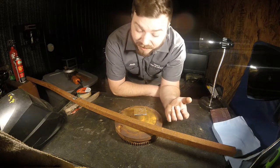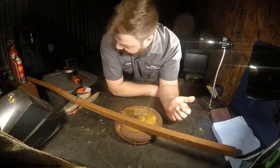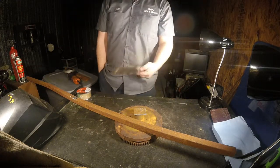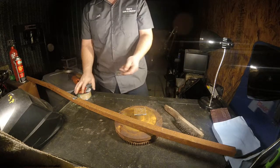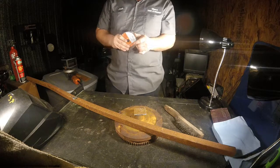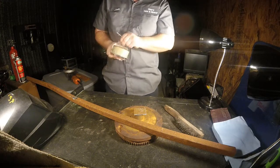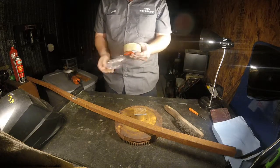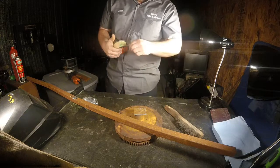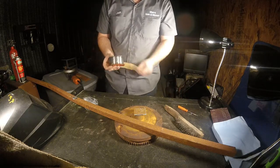And these welds aren't going to look very good because of the dissimilar metals and the rust and all that good stuff. But I'm not even going to use this except to get the slag off of the welds, because it just really doesn't matter that much. That's one nice thing about using flux core wire. If I was using gas, none of this would be acceptable. Flux core just kind of burns through all the rust, and you're allowed to have subpar conditions.